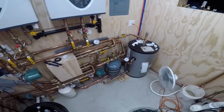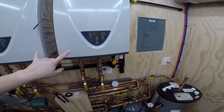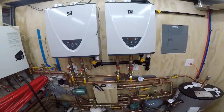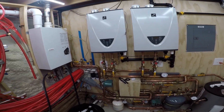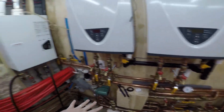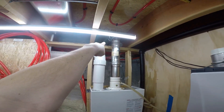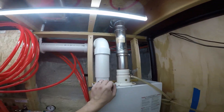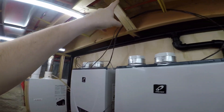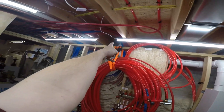As long as I don't have any leaks and I can fill the tank, and I have one of the vents done, I'll probably unlink them for now or just leave this unit off so it's only using one. Once I'm on one of them with my domestic, I no longer need this — I can take the whole thing out, pull out that stainless steel, the old Z vent gas. And I'm going to use that hole for this unit with another concentric vent kit, so intake and exhaust will go out there. I'll have unit number one going out there, unit number two going out there.